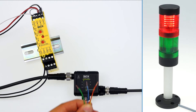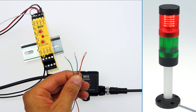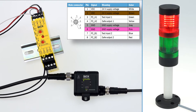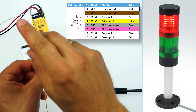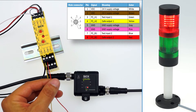Here are the remaining wires of the cable which we used before to supply the master node with power. Let's now connect them to the Flexi-Classic — the yellow wire to i1 and the red wire to i2.